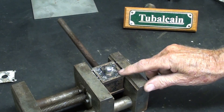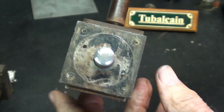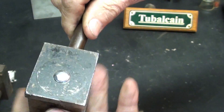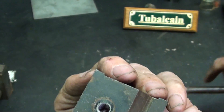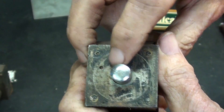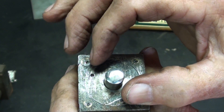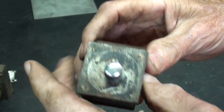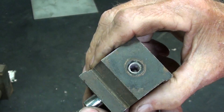I'm going to have to clean this up with a wire brush. I can't even tell how that's put together at this point. For the life of me, I can't figure out how to take this apart — there are no hidden fasteners. I thought maybe this whole thing would drive out, or the whole push button would push out one way or the other, so I took the stem out. By the way, this was held in with Loctite — you can always tell that. The only thing I can think of is there are two little holes right here. They're blind holes. Possibly they're holes for some kind of pin spanner to turn this out, so I'll experiment with that off camera.